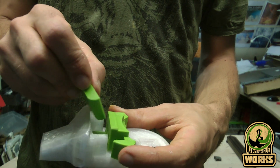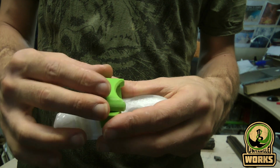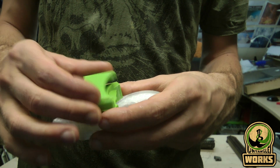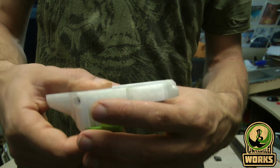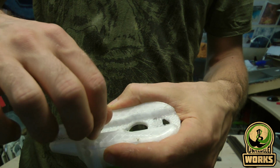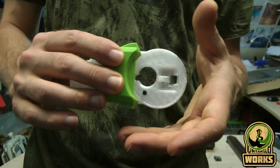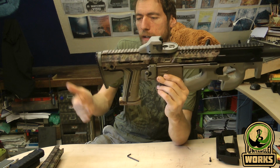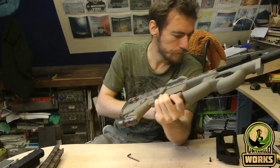But anyways, you will put those inside of there. Of course, make sure beforehand that this moves smoothly, and that when you put the plate on it, it still moves easily. If that's the case, just put the springs inside, put this plate there, and put in the 2 bolts that will be noted in the documentation, and just screw them in. Then this part is finished, and you don't really need to disassemble it in later stages. Now you can just slide it in and turn the bolts tighter so it will not be easy to remove.